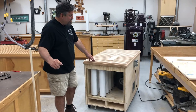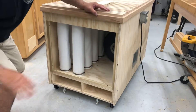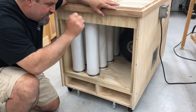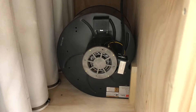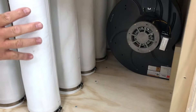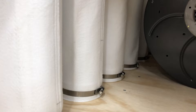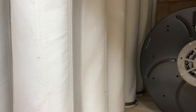This table is 48 by 30 inches and 34 inches tall. It's sitting on casters so you can roll it around your shop. It's powered by a 1000 CFM squirrel cage blower and exhausts around the backside. What makes this table great is these polyester felt tube filters — there are 14 of them, and combined there's 28 square feet of surface area, so the air-to-cloth ratio is pretty good.